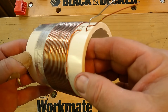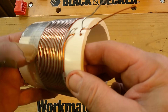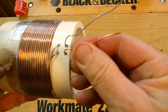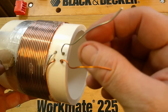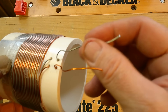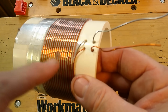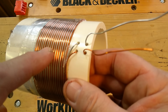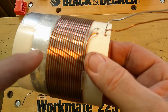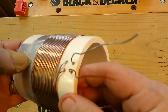I wound coils of wire over the aluminum tape and the packing tape as tight as I could get it, using two different kinds of wire. This is enameled copper magnet wire, 18 gauge, and this wire here is pure zinc wire, 18 gauge — not coated with anything, just bare wire. It's kind of like a bifilar-wound coil, but it's meant to be a multi-plate capacitor. I didn't have quite enough to cover the whole thing, but I got enough on there to demonstrate the effect I wanted to show.